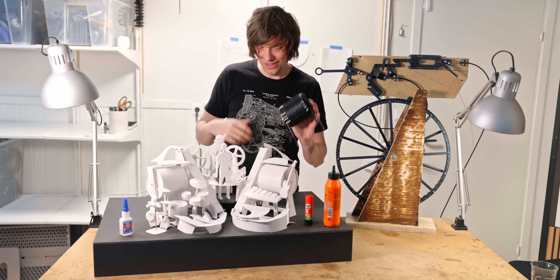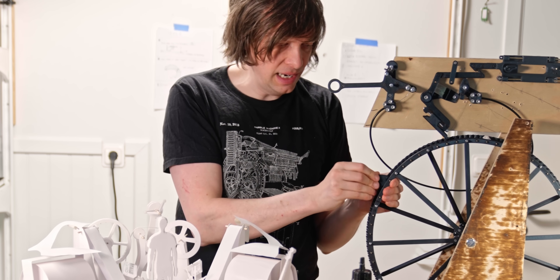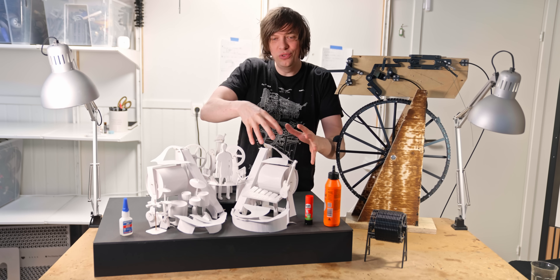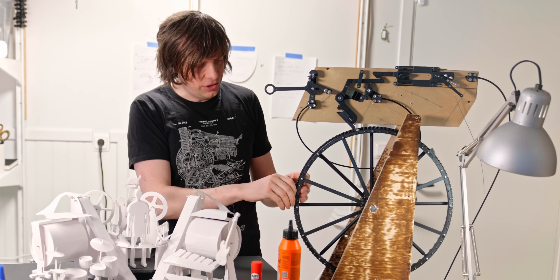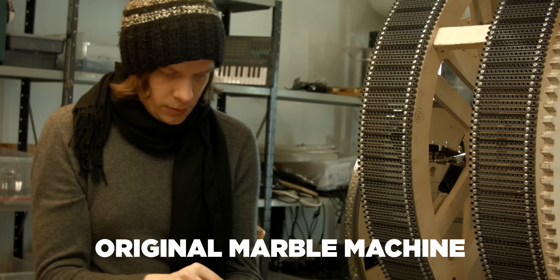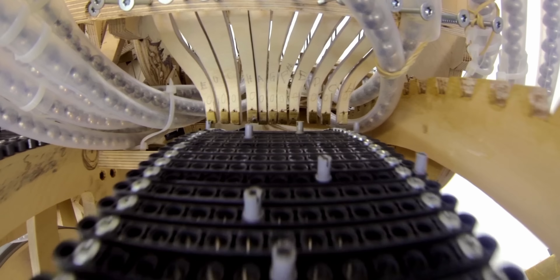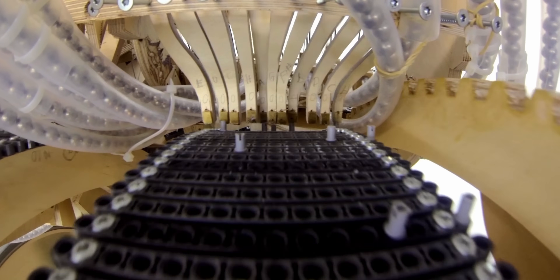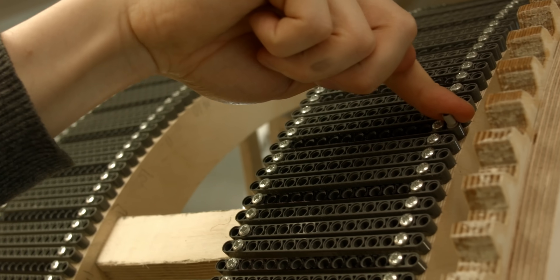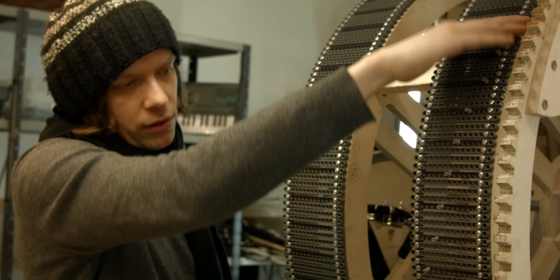That's going to be brilliant. On the previous solutions I could insert music notes manually — I could take the programming wheel and just snap it in place, click it in like that, and we have a note. This is pretty important because then I can compose music on the machine. I can make a bass line, listen to how it sounds, and alter it — move a note a little bit earlier and listen to how that sounds. The way you program it is that you put these little Lego Technic nails in. When they travel on the programming wheel, they engage the lifting fingers, which release the marble. So when you put them in there, the vibraphone will play from its lowest note up to its highest.